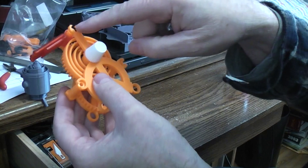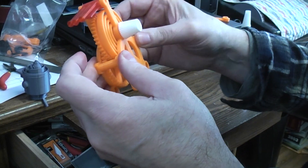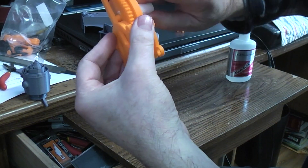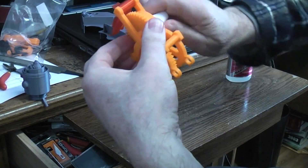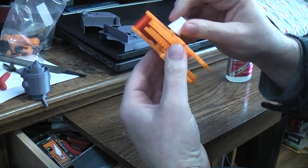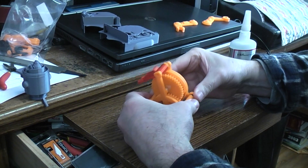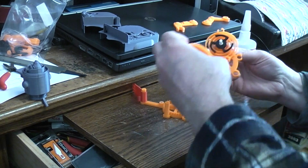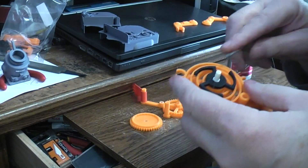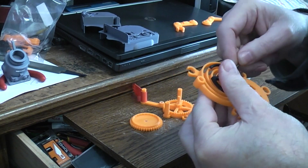If you had any flashing in these areas, you'll want to clean those off a little with your knife, but they should all slide in flush. The spring should now be captured, and you should be able to hold the gear with your hand and wind things up. But because I see everything backwards in the camera, I just put it on wrong. If the glue has set up and I can't pry it loose, we'd have to make new parts and start again.